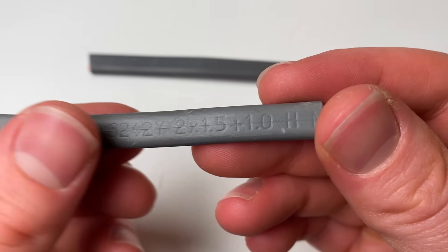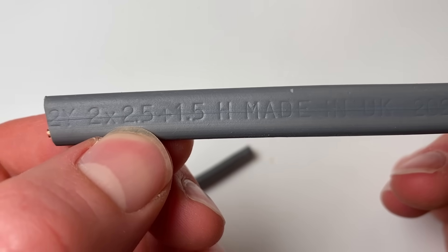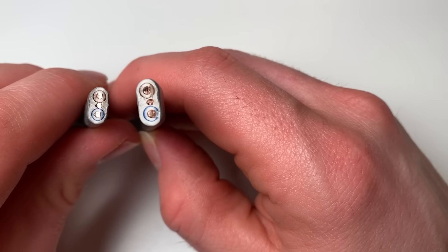The next error is using cable that is too thin for socket circuits. Lighting circuits typically use 1.5mm or even 1mm cable, whereas sockets require 2.5mm cable. The thicker a cable is, the more current it can carry — lighting circuits don't need much current capacity as lights use very little power, but socket circuits must use at least 2.5mm cable, and wiring to any additional sockets must also use 2.5mm cable to be compliant and safe.